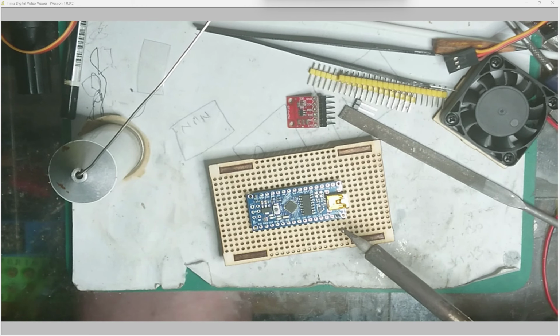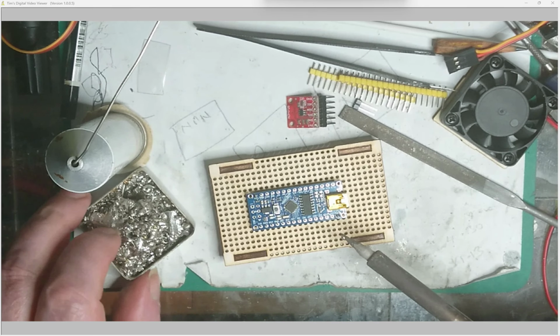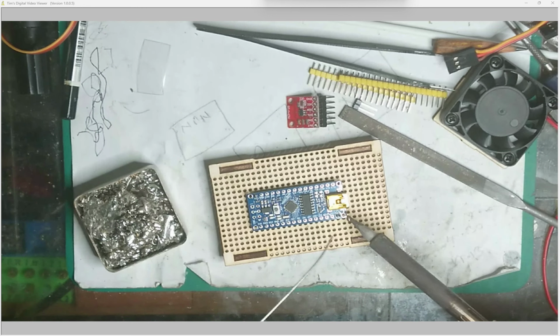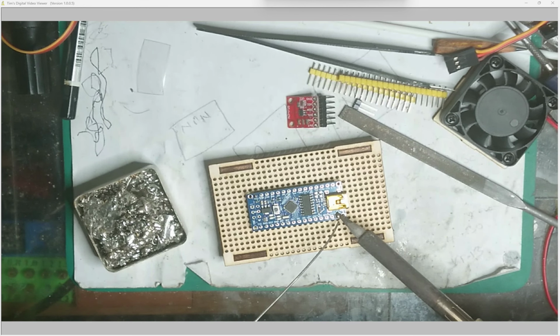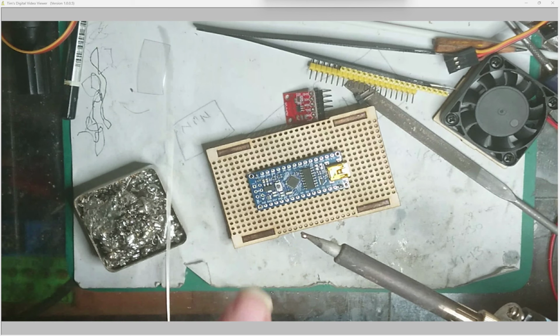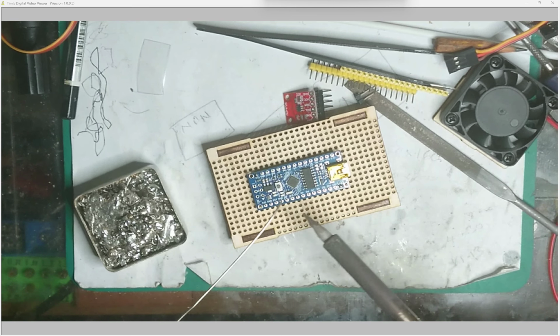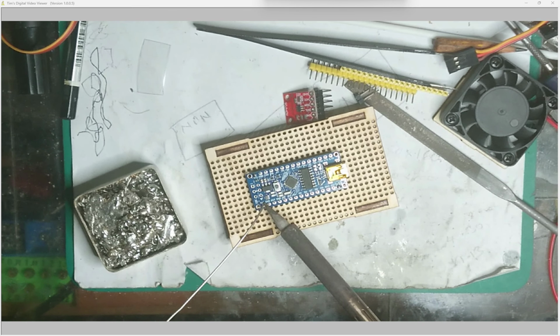And maybe you'll see how I tend to do my soldering. If you're wondering what this is, it's all solder. But you know how you get lots of flux on your soldering iron, and because this solder's a flux core, sometimes you might need an extra bit of flux to go through. You end up building up the amount of solder on there, and I just use that. You get a nice build up, but all you have to do is touch it and you've just got it cleaned. And you can start with some nice fresh solder with some flux on.